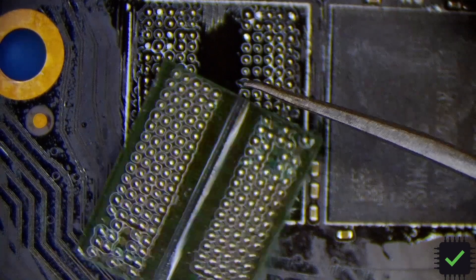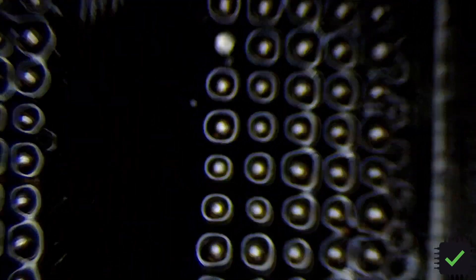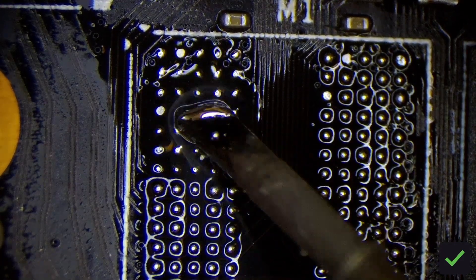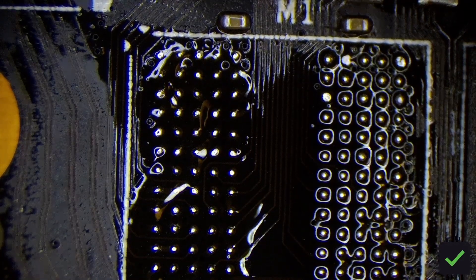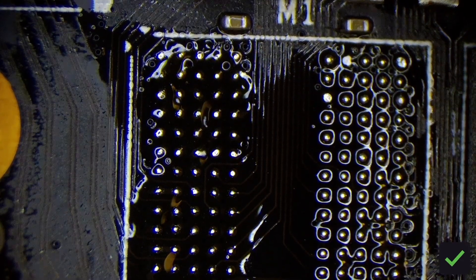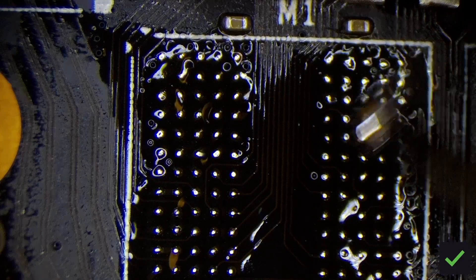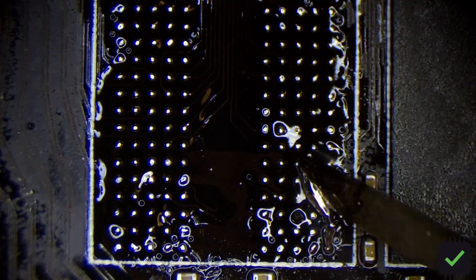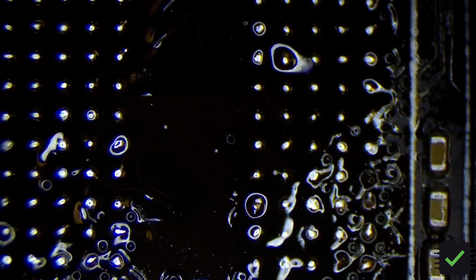As you can see on this chip, I already tried to fix it but it was basically too damaged — that's the deal with that one. Let me clean it up. I'm not going to wick it because I still want to leave a little bit of leaded solder on the pads, since this is leaded solder here.